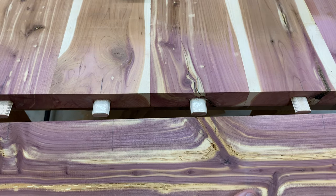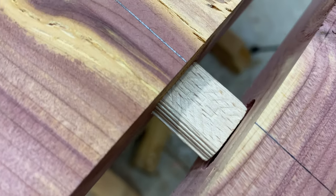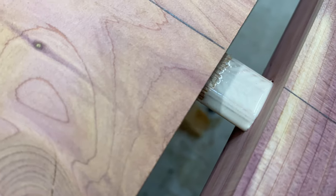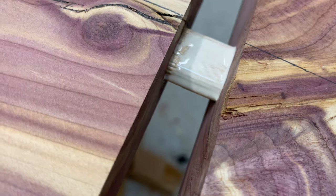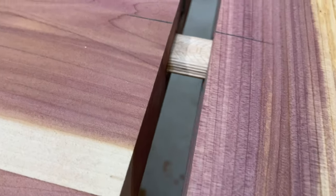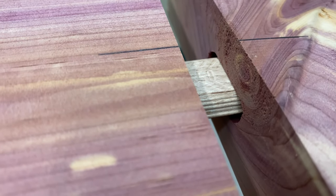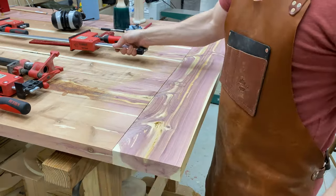As you can see in this shot, we have gap on the outside mortises, then snug fit and glue on the two center mortises, and then gap and no glue on the outside mortises and dominoes on the other side. Now we get it nice and snugly clamped.